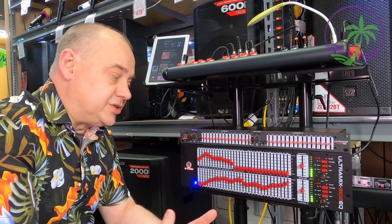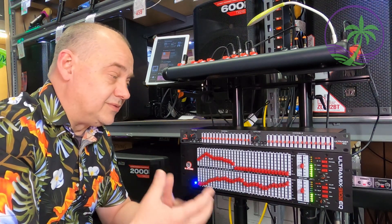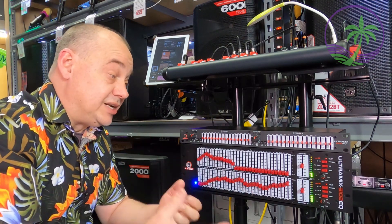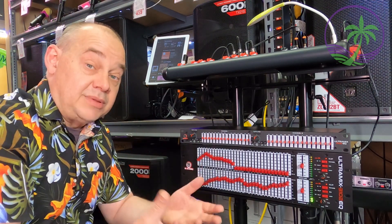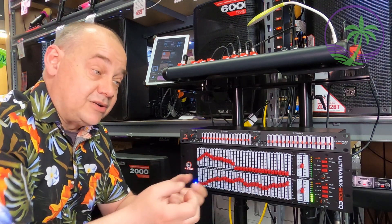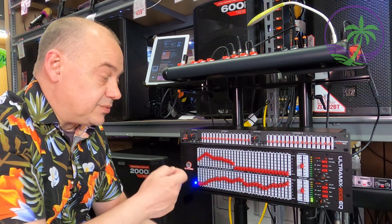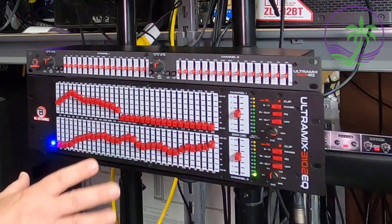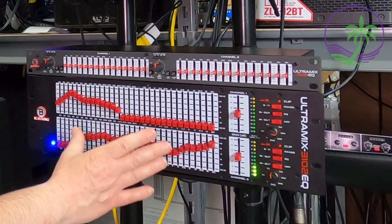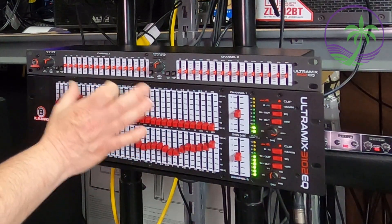As you work with speakers you'll realize that every brand, every model, every size has its own little flavor — its programmed sound quality — reflecting what the engineer who designed it was going for, and you probably bought it because of that sound. But that doesn't mean you can't adjust it, make it better, and get more out of it by adding an EQ. I've separated the top speakers onto channel 2 and the subwoofer onto channel 1.